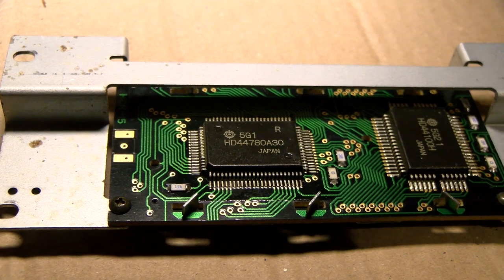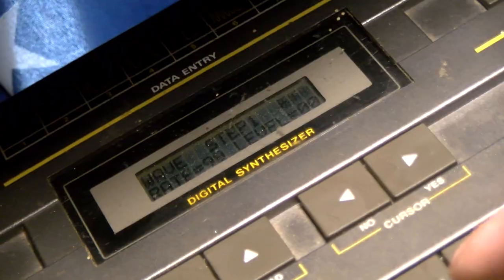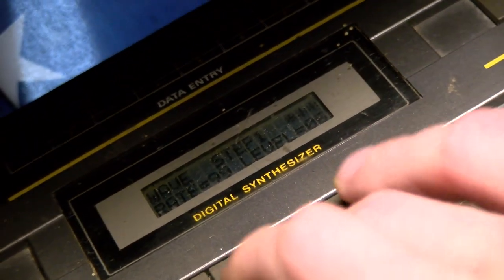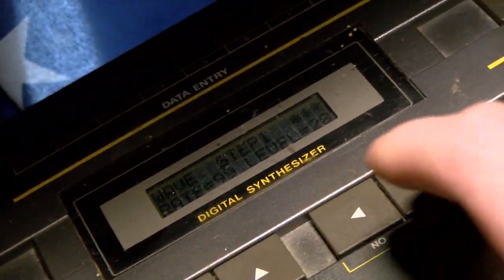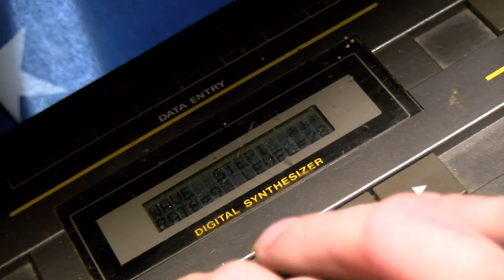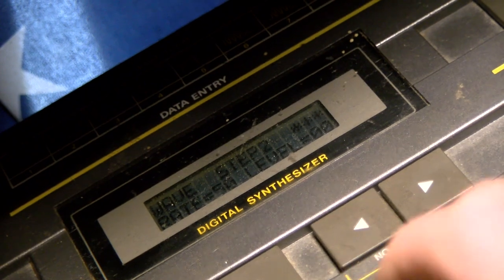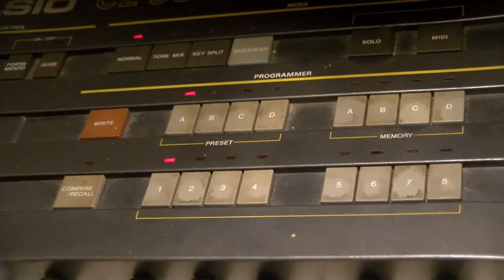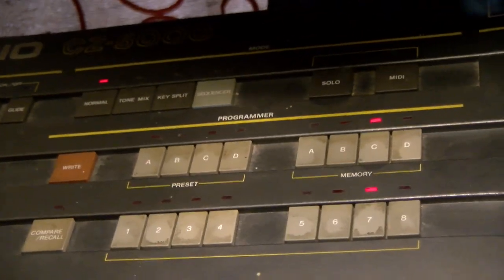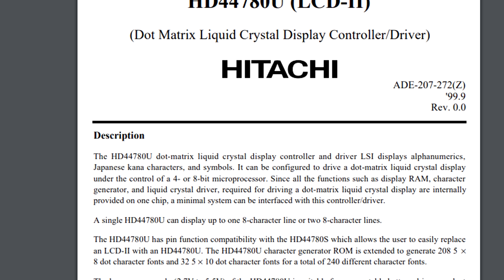No, but the IC is something of a standard for LCD displays, namely dot character displays, and, well, that's what this is. It's a 16x2 dot character LCD display. Each character is in a 5x8 block of dots, or I think it's 5x8, I can't actually remember. As it happens, displays like this turn up bloody everywhere. All Casio CZ instruments and the RZ1 drum machine use the same display or some variant of it. I'm fairly sure the Akai S2000 uses one, but it might be a Toshiba in there. Washing machines, boilers and Arduinos actually use them.